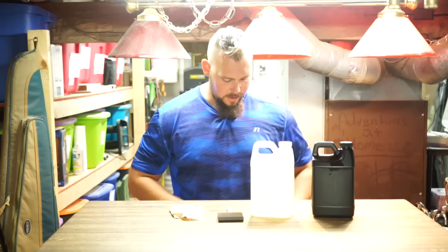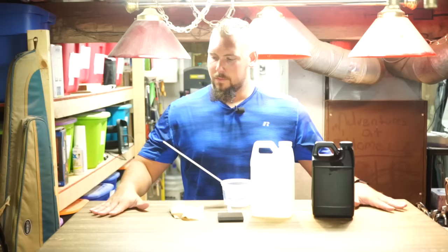For the first step I've got a pre-mixed set ready. One of the tips is that because this is a large table and the oak is quite porous, we're actually going to put a thin coat on before we do the final flood coat. That makes a huge difference getting all the air bubbles out. We also have a couple of spots with dents in the wood that we're going to fill with this thin coat first.